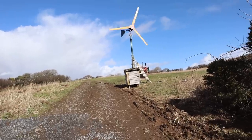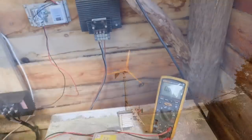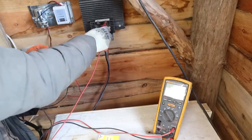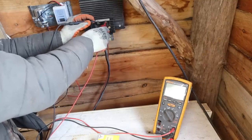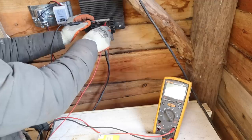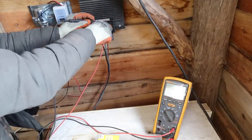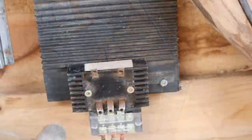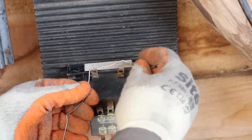It's connected up in the box, so we'll go down into the shed and see if we get any voltage off of it. It's very calm today — there was a bit of a burst of wind as I was doing it, but now it's pretty calm. I'm seeing a really good voltage off of that — 40 volts! It's not making any power at the minute as it's got no load on it, but it means that in a fairly small wind we'll get the voltage we need, no problem. I was a bit worried because the coil was wound for 12 volt — made it for a different situation — but it's actually doing right. That was just a little burst of about 6-7 mile an hour wind and we got up to 40 volts, so I'm pleased with that.